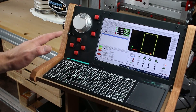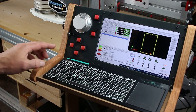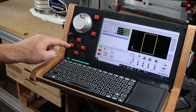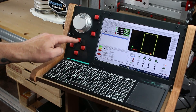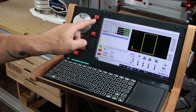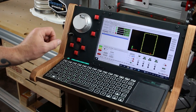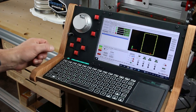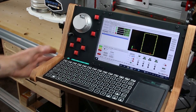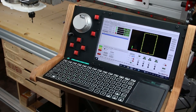Alright, it is done and everything works — just the way I like it. We've got the encoder wheel here, the rotary switch, and all of the jog buttons: forward, backward, left, right, Z-axis down, and Z-axis up. With the rotary switch I can change which axis the encoder controls. On the jog buttons, if I push a button it'll move the cut head just a little bit in one direction. If I hold it down, it travels until I let go.